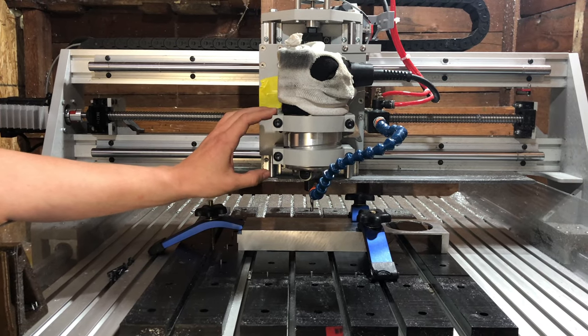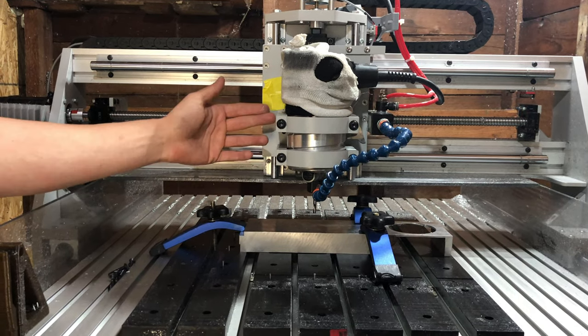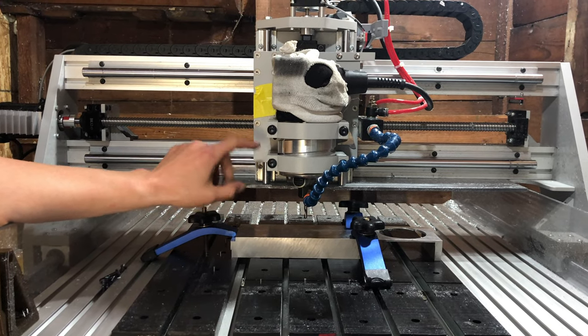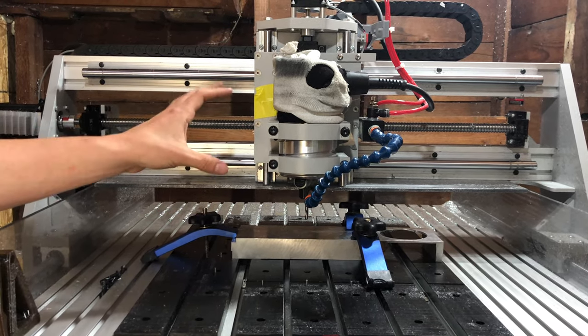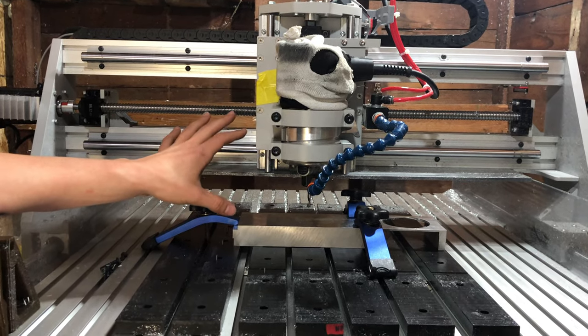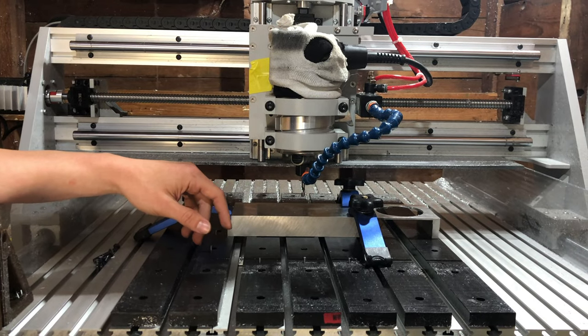I'd like to see a one-piece design with a precision hole that is parallel to the mating surface. And then I would also like to see jack screws on the back so that you can adjust everything and tram it in and then lock it down. Right now, when you're trying to move things around and lock it down, you're fighting yourself and running in circles.